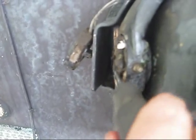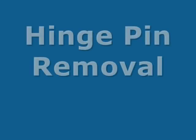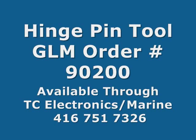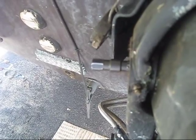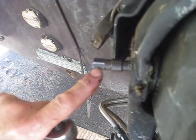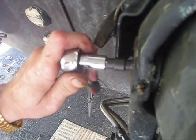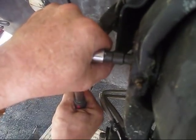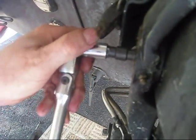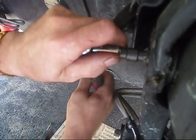The hinge pin will slide into this area here. To get at the hinge pin, you'll have to turn the out drive so you have access to it. This is a hinge pin tool, which can be purchased from any dealer. This is the hinge pin in here and you'll need a wrench — sometimes with an extension. It can be very hard to pull off periodically. Some come easy based on whether they've been greased and how much calcium is in it. This one's coming off relatively easy.